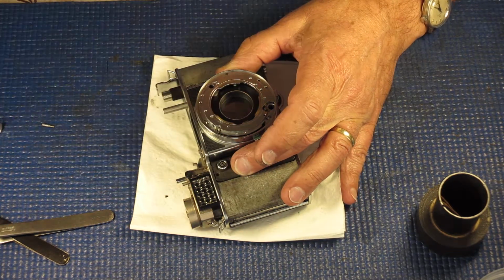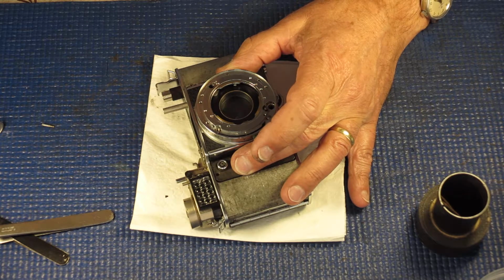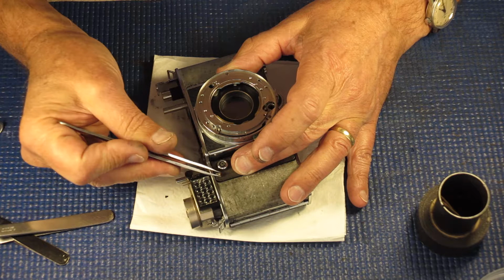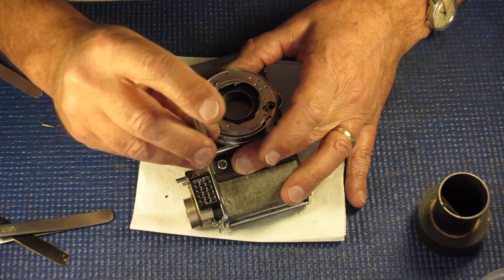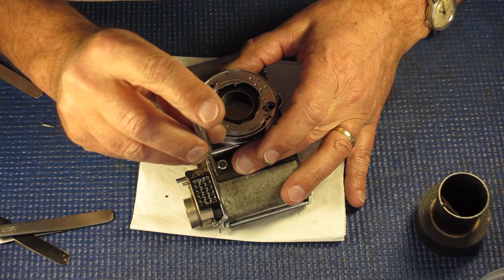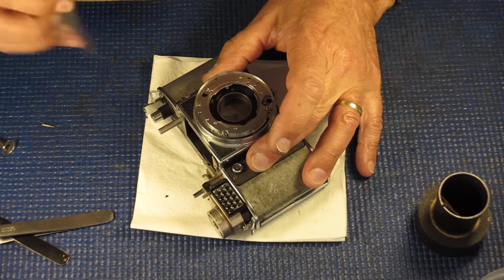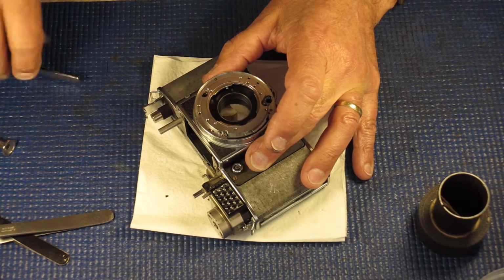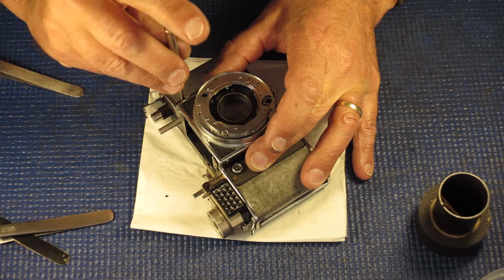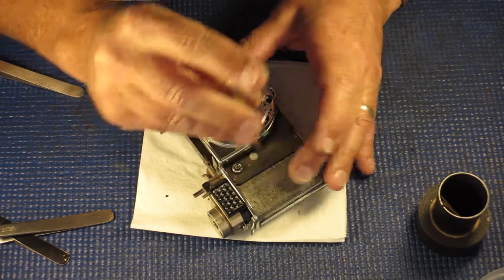They'll be done up loosely, and then following those screws we've put in the shaft that couples to the meter drum. But these screws don't get done up tight until that's in place, because it's awkward to position that. You don't need any extra fights. Let's have four screws for the front. I'll just do those down lightly.